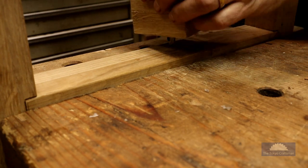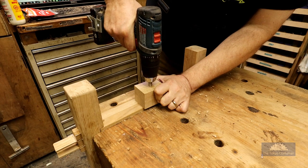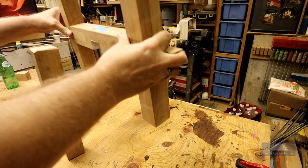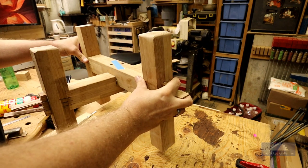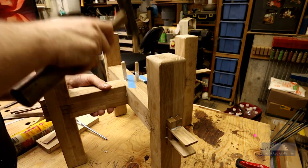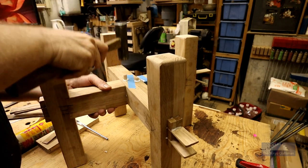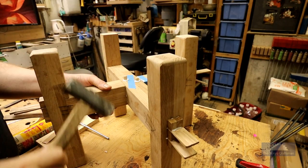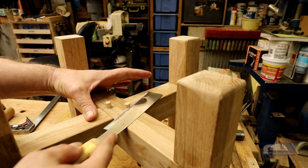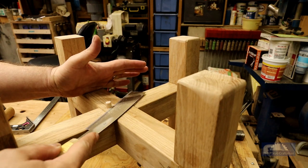There I am drilling the holes. I put four dowels in the middle of the cross so that it would hold together for sure. Doing the glue-up of the two sets of legs — just pounding some ten-millimeter dowels in there, two from the top, two from the bottom on opposite parts. Wipe off all the glue and get the flush cuts out. Ended up with the legs being slightly different lengths so I had to take the belt sander to the bottoms of the legs to make them all the same length. But it worked out fine.